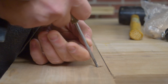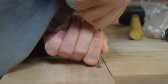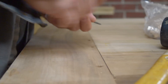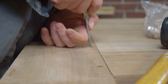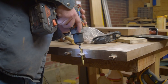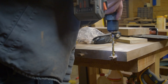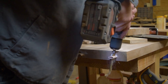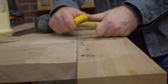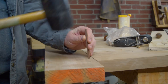You're going to mark the holes at the center of each domino, but when you go to drill the holes into the floating tenon you're going to drill those about a sixteenth-inch offset towards the tabletop. This is the same as installing a normal breadboard end but you've cut out all the work of drilling all the mortises and cutting all the tenons. A trick to prevent a bunch of filing and adjusting: just wiggle the drill bit a little bit — this will elongate the hole just enough so you'll have room for expansion and contraction of the pins once those breadboard ends are installed. Just like with a classic breadboard, you'll want to sharpen your pins just a little bit so they'll help cinch the breadboard up against the tabletop, then gently pound in your pins.